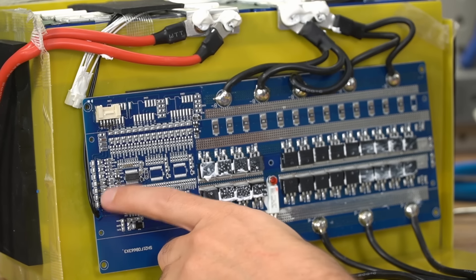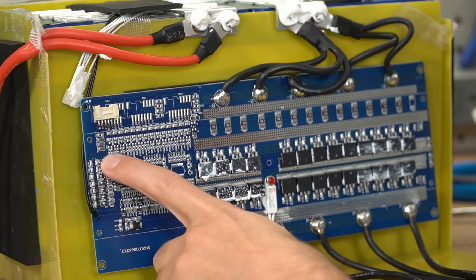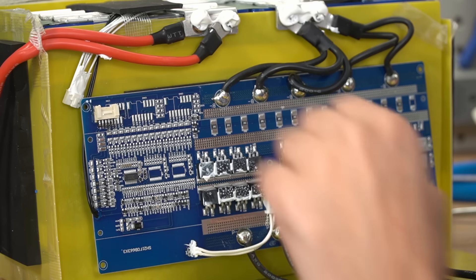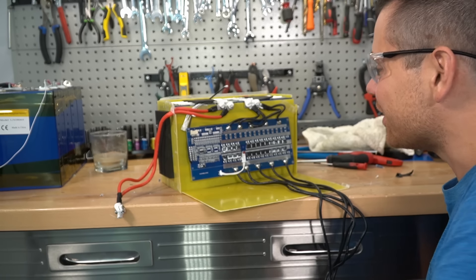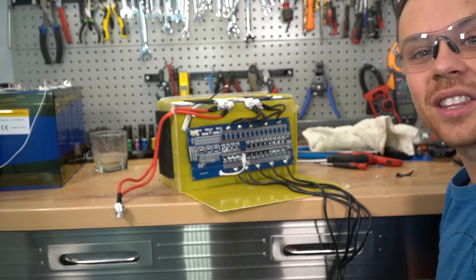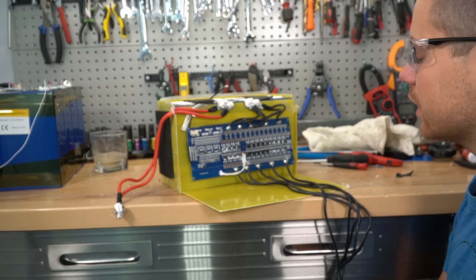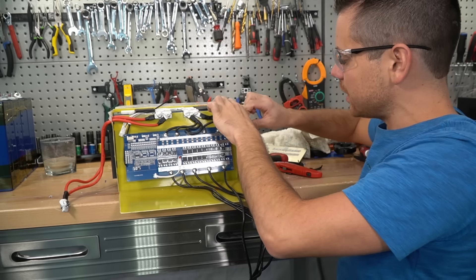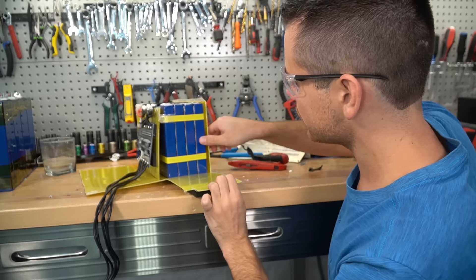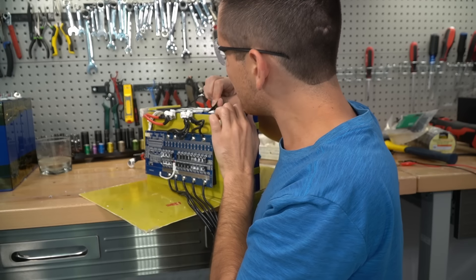We're going to disconnect this BMS from the battery. There are a few screws on the bottom holding the heat sink in place. If we just wipe off this paste, we can see the number on the FET. Now we have a number, so I'm going to try to find this FET's data sheet and see what the voltage rating is. I already looked up this FET a few months ago — it can handle 85 volts, so this thing can easily handle a 48 volt battery if you were to put four of them in series. That's fantastic. They have low temp charging protection and you can put them in series. Each FET can handle 208 watts — obviously that's overkill and it's only there so they can handle surge events.